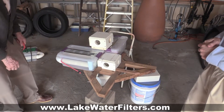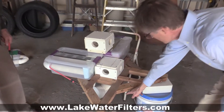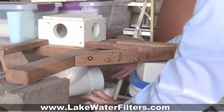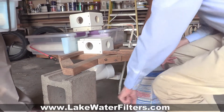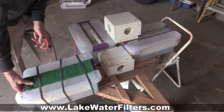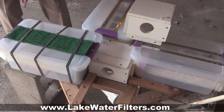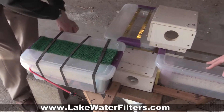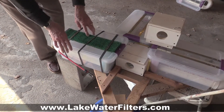That would come right under the middle here and suck from the four-inch pipe, giving you good flow. The water is sucked down through here, through the screen, then goes into the middle and down — it goes out one direction while the other direction is blocked, depending on how the submersible pump works. It sends water one way, the back is blocked, and your feed line goes out one way. Here's the one with the filter right on top — you can see how easy they go together. There's a little gasket that holds it in place, and then there's just a screw or eye that goes around the top and hooks on to keep it in place.